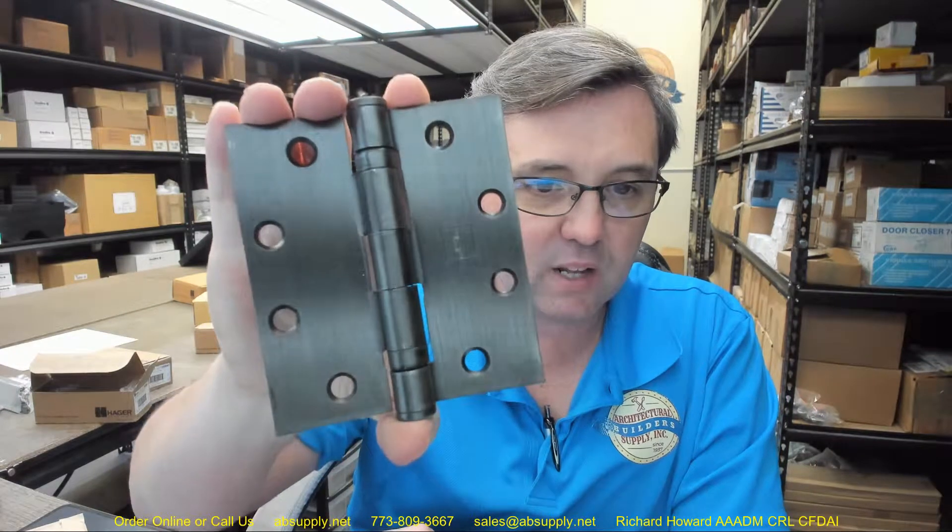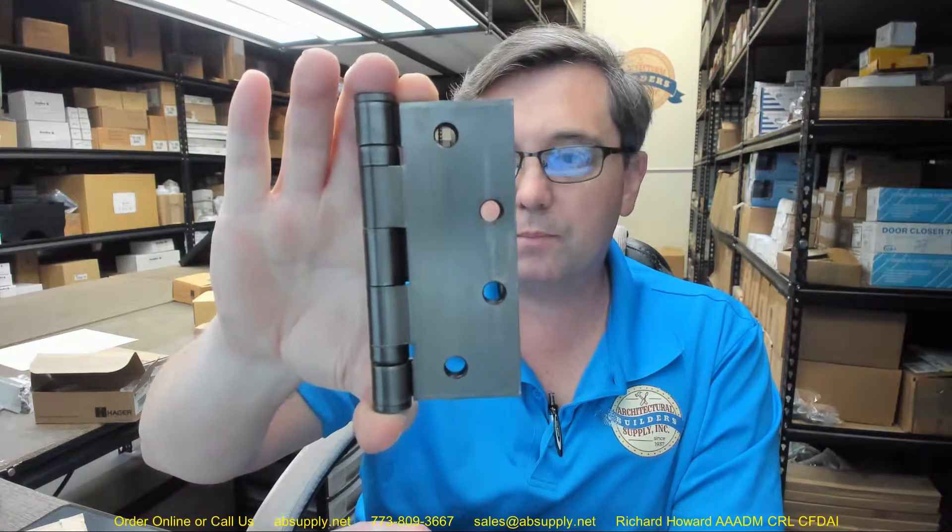This job that we're doing, the client has a knockdown drywall frame, Dutch door and frame, and it's a five and seven eighths jamb by a four and seven eighths throat. The door is only going to go to 90 degrees because it's in a storeroom — it's in a high school, probably taking small orders through the door. It might be the door you go to between 3:30 and 4:00 to purchase your gym clothes or whatever. A four inch would really be a better application, and it's best practice. There's no reason to have a four and a half by four and a half. Four and a half by four is a better mechanical way to do it, and I would argue it's actually more aesthetically pleasing to have less projecting hardware off the face of the door and frame.